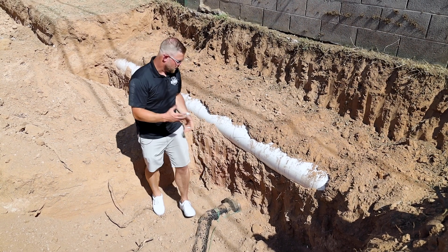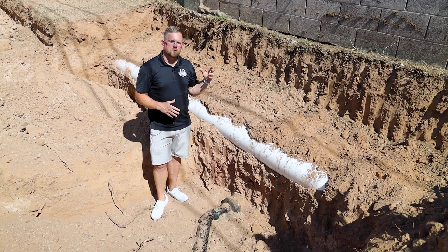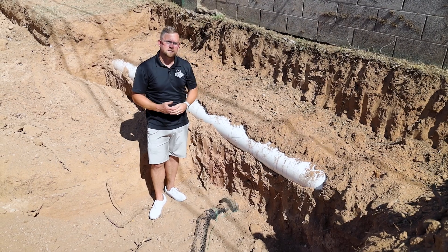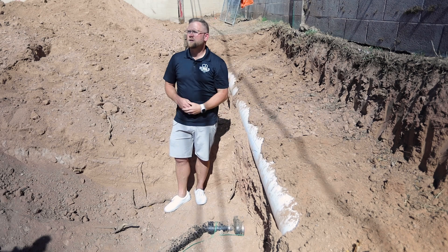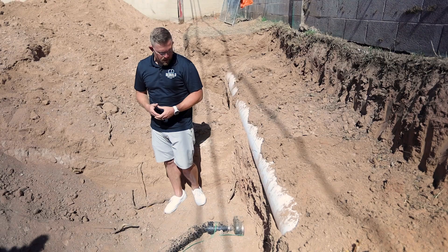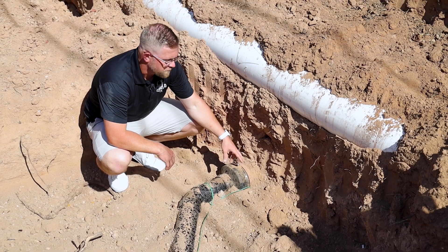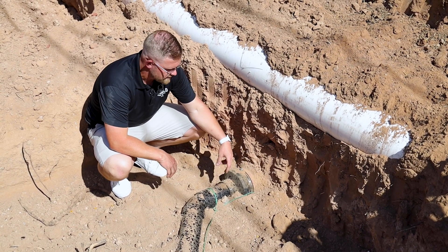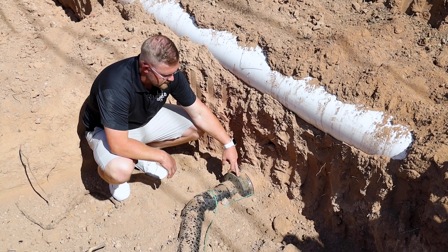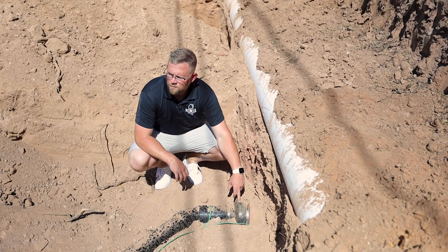I'm sitting at the main location where we're tying back into the city tap. We're currently at about five and a half feet depth for this specific lot, which typically ranges from four and a half to eight and a half feet depending on where we're tying into the city sewer system running between adjacent properties here on Monta Rosa. New code doesn't bring city taps up to current standard, so we're still using a six-inch clay pipe for new taps in Phoenix. We connect our four-inch ABS with a rubberized sleeve to allow all waste to exit the property appropriately.